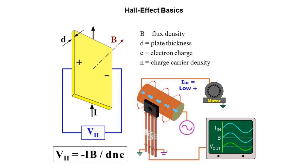So this series of sensors from Allegro, what they use is instead of having a resistor where the current goes across the resistor and you measure the voltage differential, it actually measures the magnetic field generated from current passing through a conductor. Now, you may remember this from your E&M class, as current passes through, right-hand rule, you have a magnetic field that is generated. And in this case, you just see here a Hall effect sensor demonstrating that it can measure the output. And with careful calibration, you can take that magnetic flux and back correlate it to how much current. You have to do a lot of calibration. You have to make sure that your Hall effect sensor is the same every time and that the resistor is very precise. But it is possible to get very good quality current sensing.